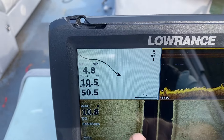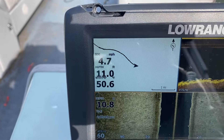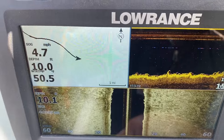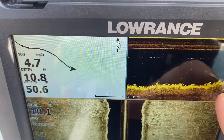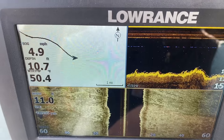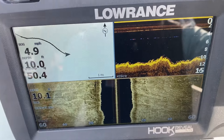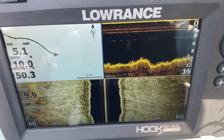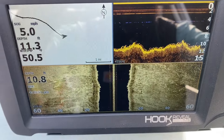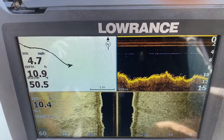You can see there's a lot of unevenness in structure on the bottom here, and here there's some kind of a little stump or log. There it's marking fish again — a few of those places there are probably clearly fish. We're moving at 4.9 miles an hour right now, and I think we're getting about the best clarity on the side scan this way. So that's probably a good speed to move. Again, it's the first time I've used it — I may find something that works better yet, but thus far that appears to be the best.